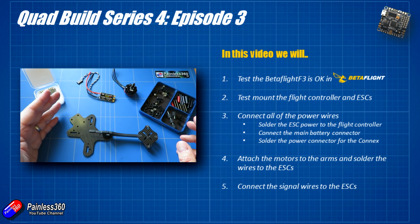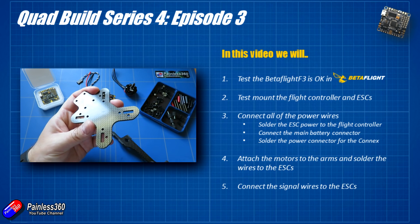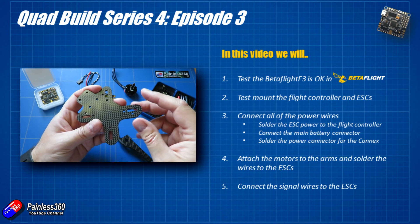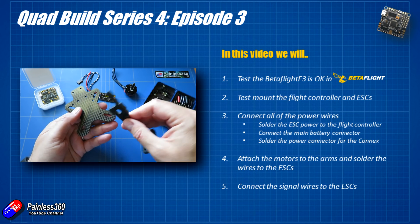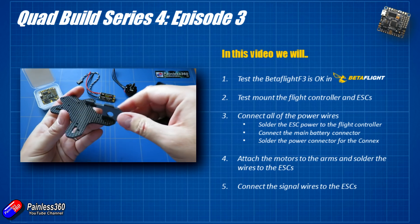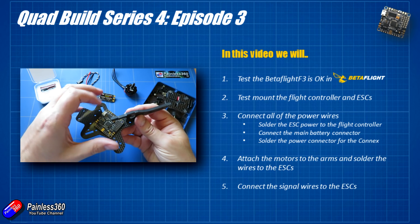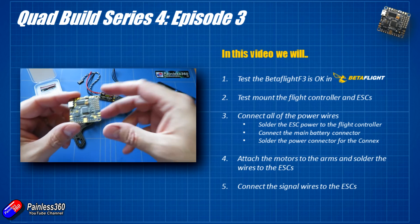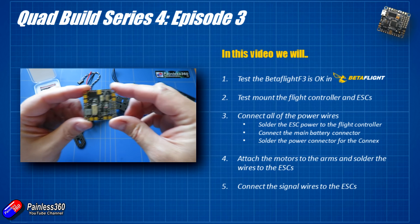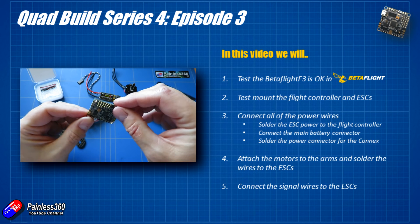The second thing we're going to do is test mount the flight controller onto the frame. This is the bottom part of the frame itself. We're going to use this VLX230C frame from Out of the Box Innovations — I'll put links to all the parts in the description. The arms are vertical and slot into the side. That's where the motor goes, and we'll have to pop the ESC on the side. The flight controller fits in the heart of everything, though we'll need to mount it slightly off the back of the plate because we have to solder things to both the top and bottom of the board, and all the power for the ESCs is actually underneath.